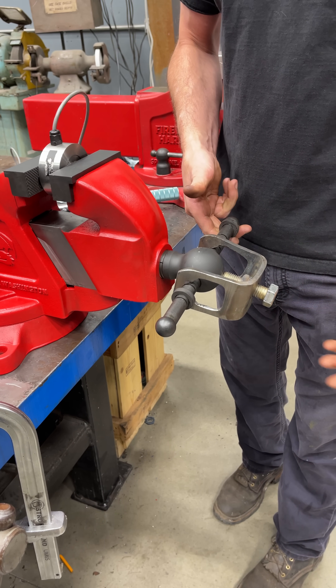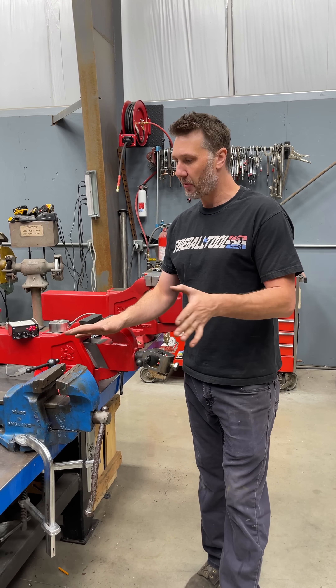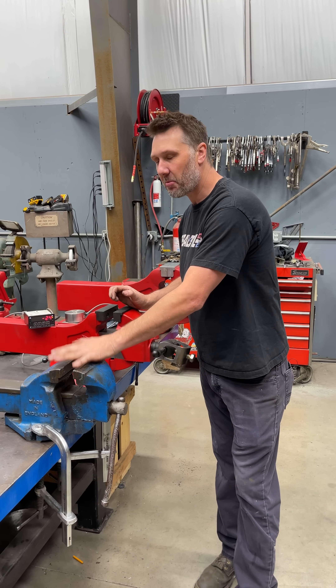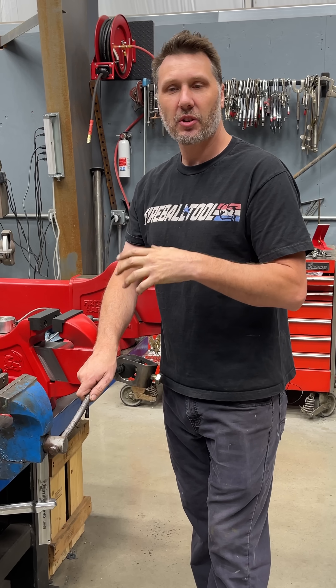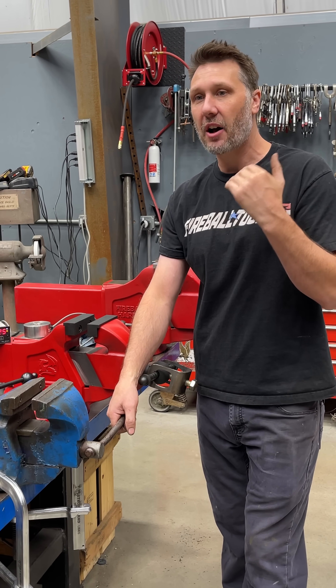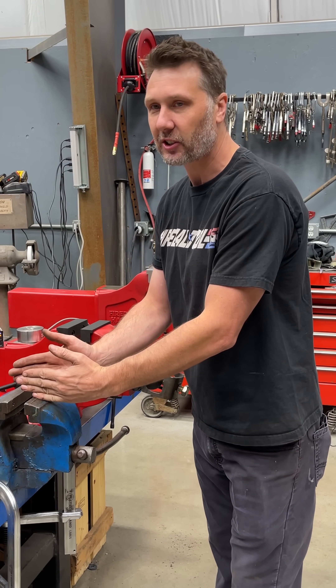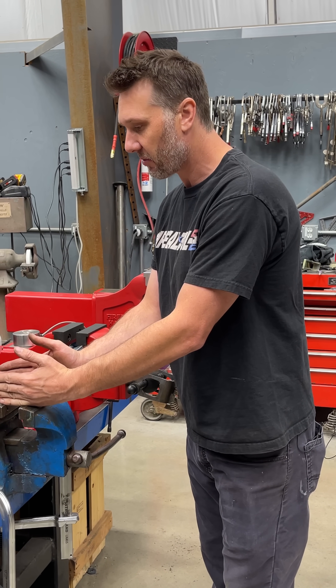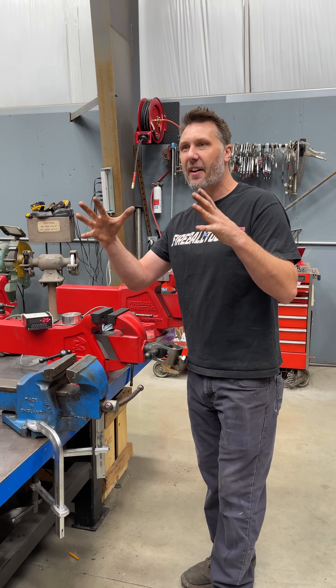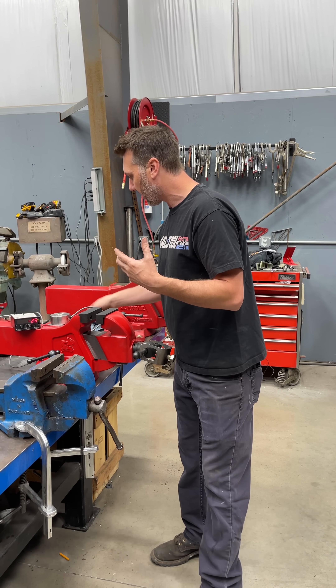So as you can see, the hard tail vise really outputs a lot of force. Now here's where I think the confusion comes from — everybody saying the number six vise is one of the best. When this vise comes up to a full stop, you probably feel like you're putting in thousands and thousands of pounds. But realistically this vise is actually really weak, and that's probably one of the reasons why there are a lot of them still around — they just don't have a lot of clamping force. But they make you feel like you've clamped a lot.